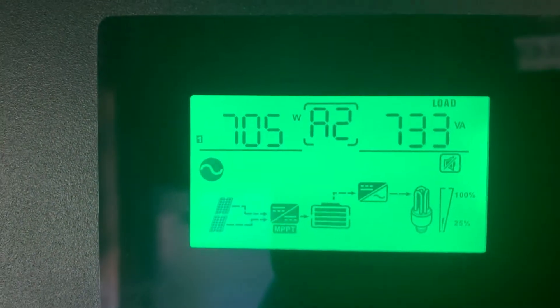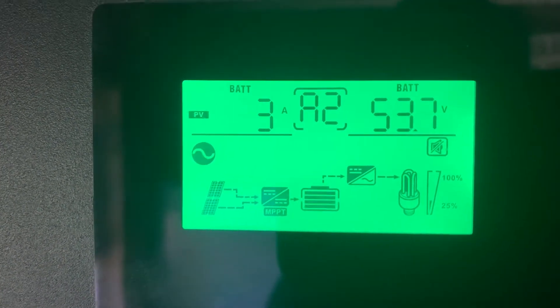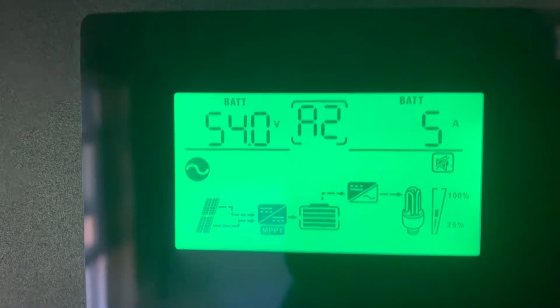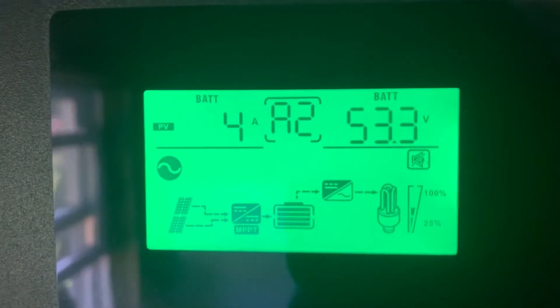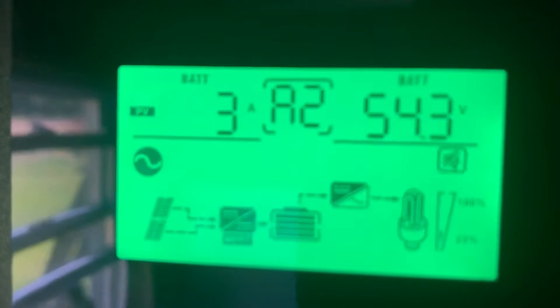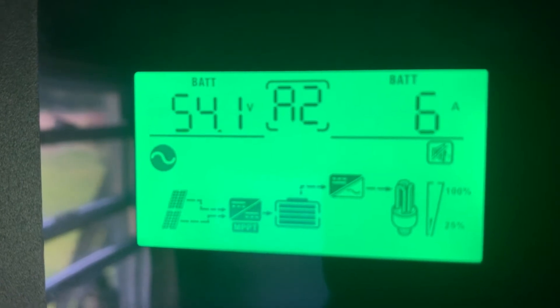I'll go through the rest of the settings with you. My battery is pretty much full and we're charging about 3 amps at 48 volts. We're using about 5 amps. I think we might be charging slightly more than that because it's not really dropping — I do have some swing because it's going back and forth. I believe this does throttle the solar input to match my load, so my panels could be making more power but it's keeping the battery on the float charge setting.